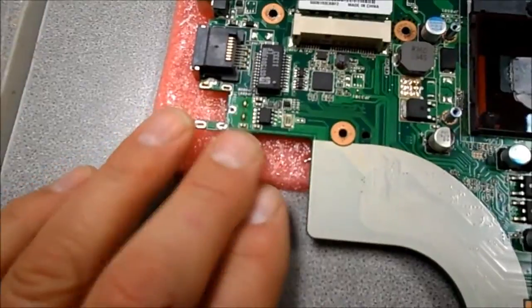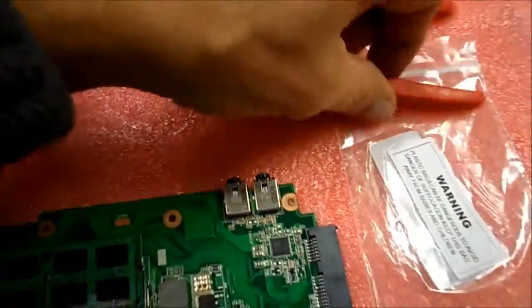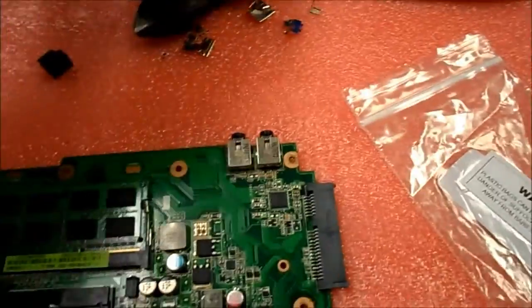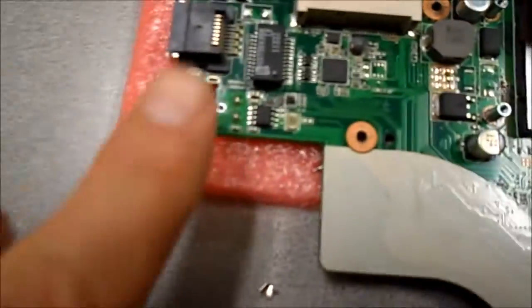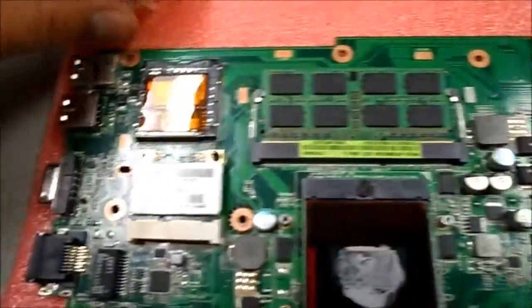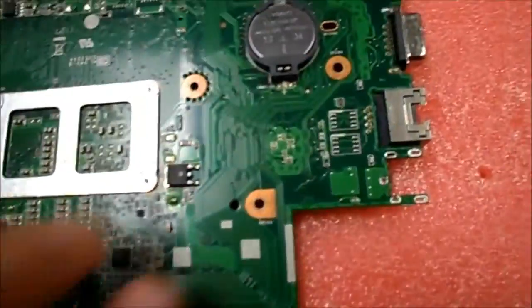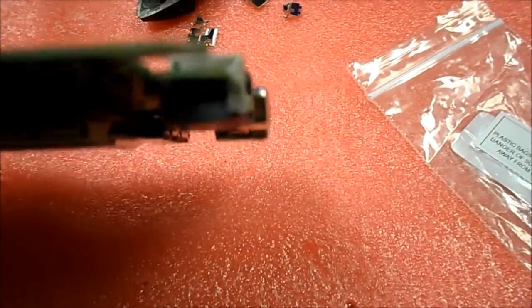We have the jack out already. What you want to do is have a good quality pair of side cutters — we use the American-made ones here — to cut the old jack out without damaging the board, because it's surrounded by the grounds. Then use the wick and carefully unsolder the fragments out once you get the jack out, because these boards can be nine layers thick, so you can't damage the center pin or any of the cladding that runs between the layers.